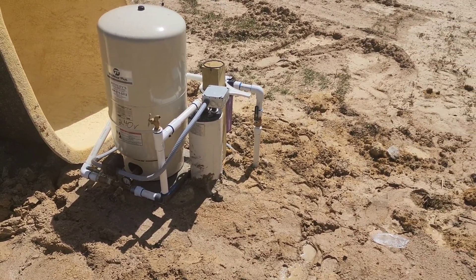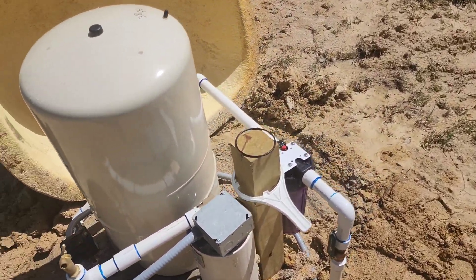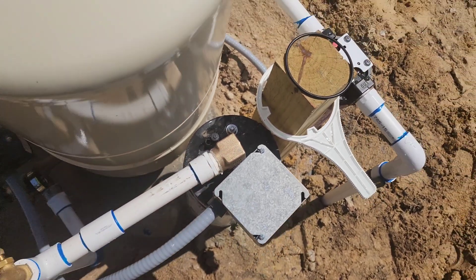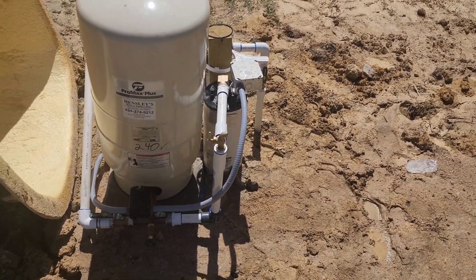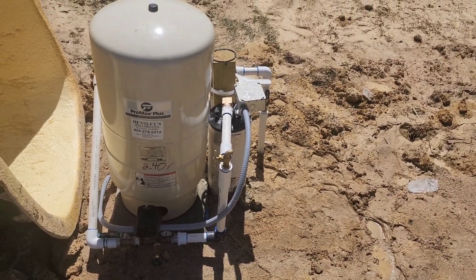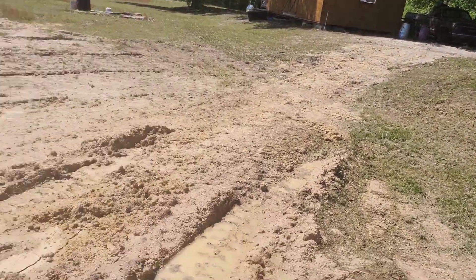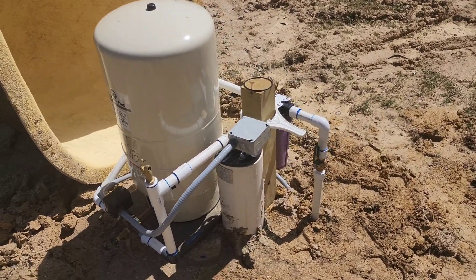The reason why I'm back here today — we just did this job like 5 days ago — it's actually the second job I've had to repair. The damn fitting here cracked. I came back and put a brass one in. We had one crack last week, and the very next job I did, that one cracked too. Either we're tightening them too tight or we got a bad batch of fittings. Brass is like four times more expensive, but the amount of fuel I spent driving an hour out here to replace a $20 fitting — it's just not worth it. I'm going to start putting brass on everything.